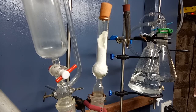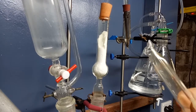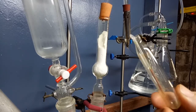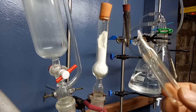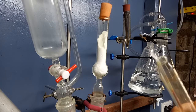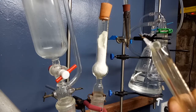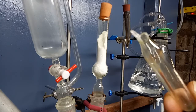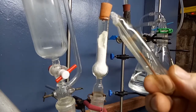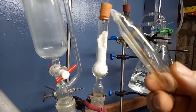As is normal for me, I have a success and a failure. I actually managed to produce some gold chloride, but I have an ampouling failure as you can see here. In the process of ampouling, two things happened: number one, by the process of heat, I managed to convert some of my gold chloride back into gold; and number two, I've got a bubble in there which has prevented it from sealing properly, which means this stuff is going to be exposed to moisture and so it's not going to last a long time. So we have dragon's blood, but I think I need to try it again.